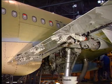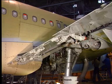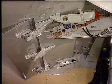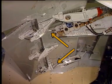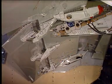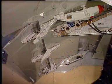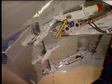The flap link arms move the flaps along the tracks on the carriages. Control rods connected between the carriages 2, 3, 4 or hinge 1A and the tabs extend the tabs at the same time. The flap link arms turn the flaps around the lateral pivot axis.